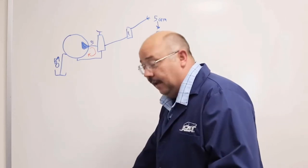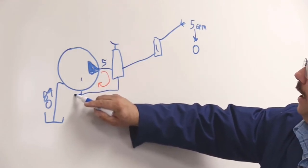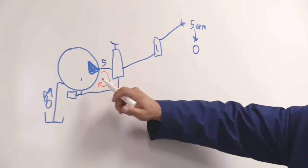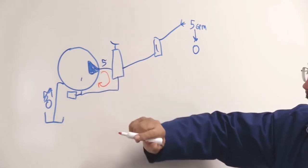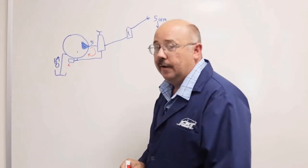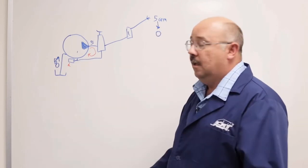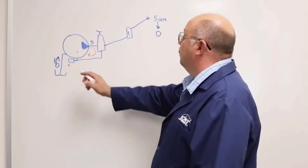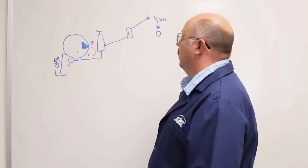And along comes the thermal valve. Where this tees back into the pump, we'll add a thermal valve right there. As this loop is running and the temperature rises, this thermal valve will watch it, and as soon as it gets to a certain point, it will open and discharge some water out there. Of course, we always want to be careful that this discharge is not directed at any person or animals for injury or anything like that. So consider that when doing the mounting and the plumbing. There is a port on the thermal valve where you can add a small hose barb and a hose to direct it where you need to.